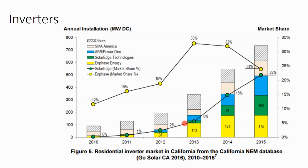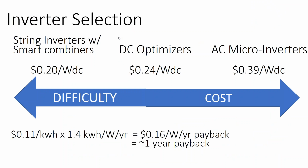All of that added up to say, if you're a solar installer, maybe the Enphase microinverter system is a little bit easier to install, but you're going to go after the cost savings of the otherwise equivalent or perhaps better system. I would still absolutely recommend microinverters for do-it-yourselfers who are not very comfortable doing electrical work. It's the most plug-and-play system, but it isn't without its detriments. If I'm using a professional installer, I'd probably want them to not use microinverters, but to go with a DC optimizer system if I wanted that module level performance.